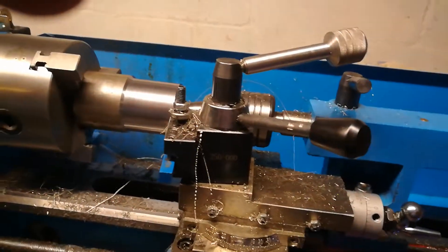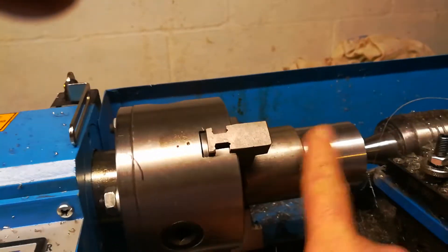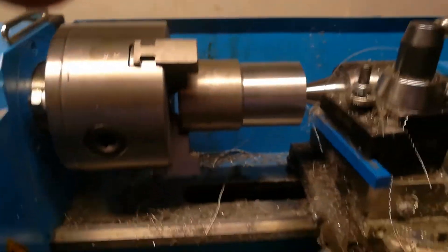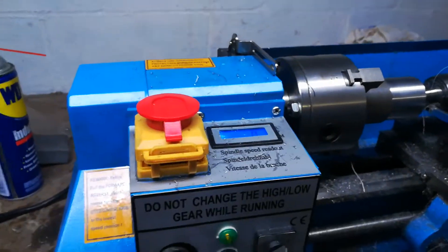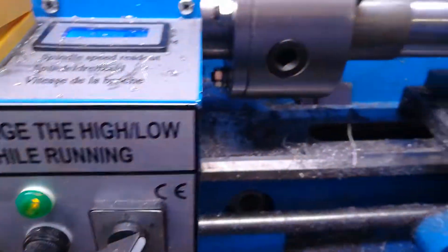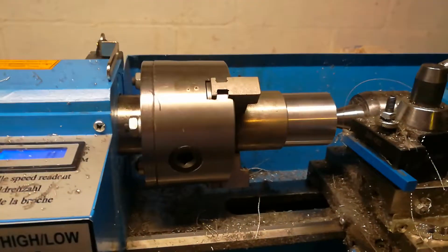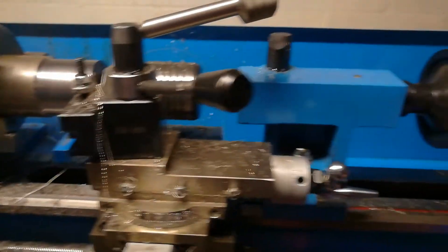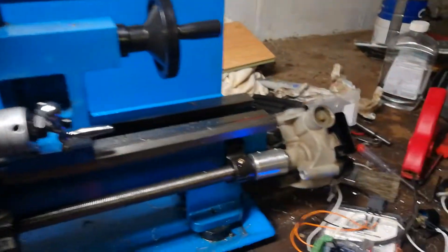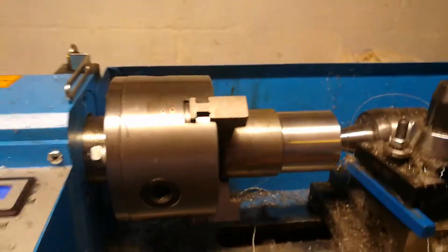I'm getting a lot smoother cuts now that I'm able to slow it down. That was my last cut and it's pretty good — better than what I was getting at the original speed of the lathe. I disconnected the gear that runs the lead screw so I'm not turning the gears inside the headstock, just turning the lead screw, and it works really good. When I'm done with this I'll be careful not to overbore it this time. I'm going to make the nut a press fit so it'll turn straight. Even with the runout I have now, the lead screw still works really good.